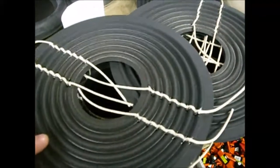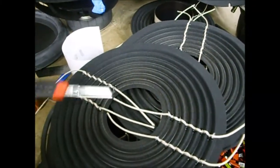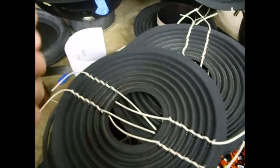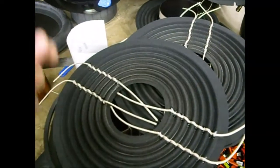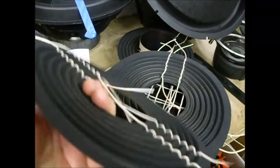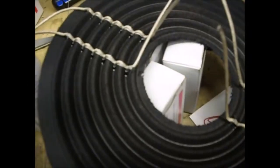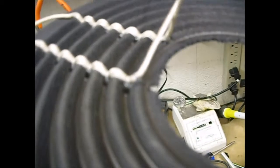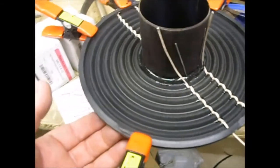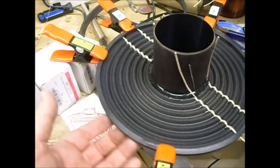Quick note before trimming the spiders: they don't actually need trimming, but they don't quite fit around the voice coil. So I just use a razor and brush the edge to fray it out so it has loose fingers and can fit over the voice coil more easily. Otherwise if it's too tight you'll get warping and it'll look like a saddle and never sit perpendicular. Just a little notch — I kept the flap on there to avoid bonding to the bottom or building up CA, so it stays fresh when you go to glue it down.